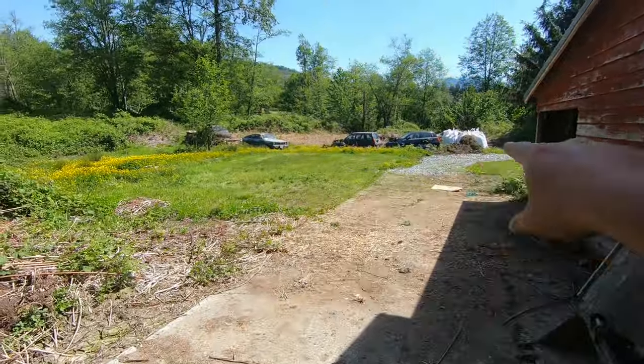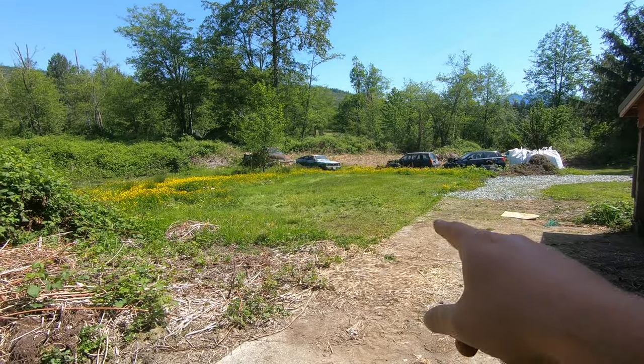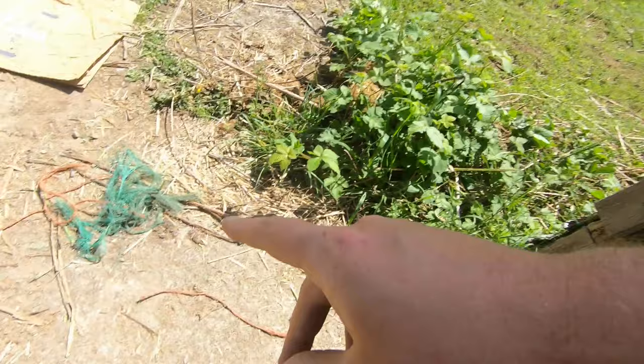So I had to mow over the same places a few times out here in the swamp grass area where originally I'd gotten that rope around the spindles. And that's another improvement I would make on this mower: you need to have spindle guards between the deck and the blades. Other mowers do that so you don't get this stuff wrapped around the spindles.